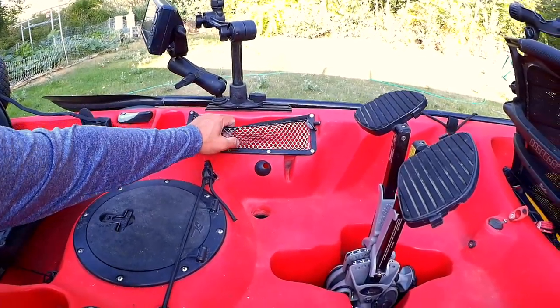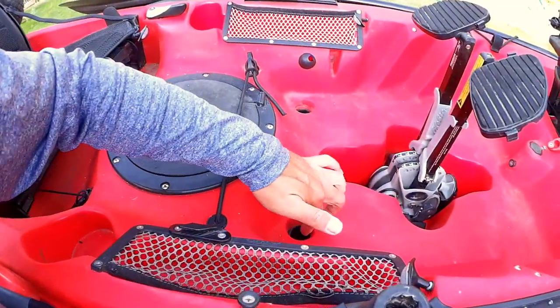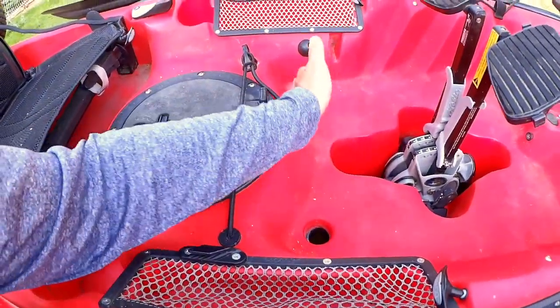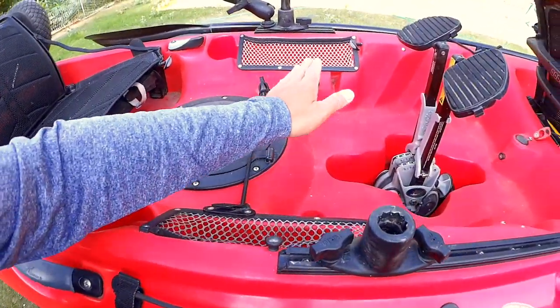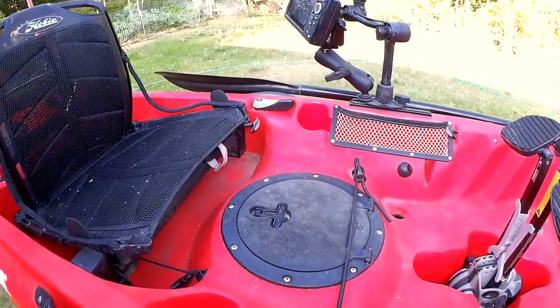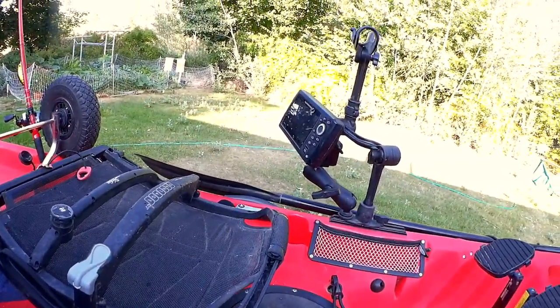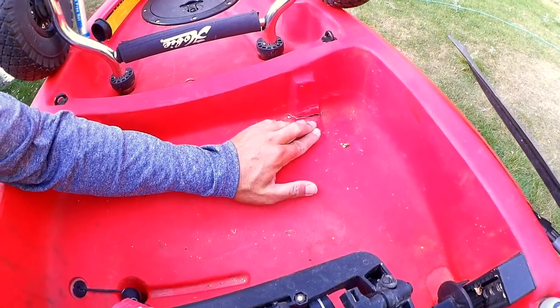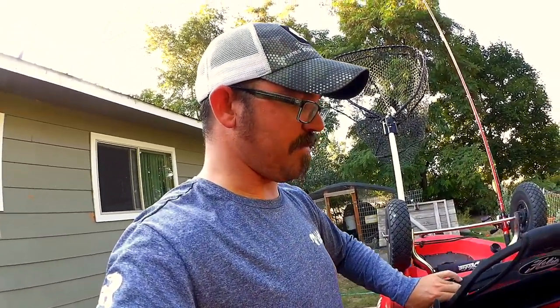Same storage areas and rudder controls on the rear cockpit. These are the reinforced scupper holes for the cart, which you can store behind the seat and lock into the center of the kayak - it makes it really easy to roll because you're fairly centered when the Hobie cart is locked into those scuppers. One issue that cropped up this year: I did develop a crack back where the seat rests. It's not lethal - I can weld it - but it is a concern. I do store my kayaks outside; I try to keep them on the shady side of the house but obviously the plastic has fatigued. It makes me think that in the near future I'm probably going to have to replace this boat.